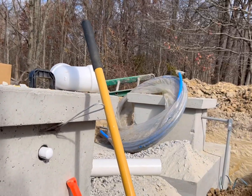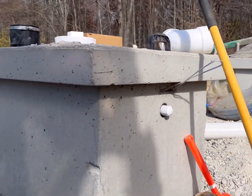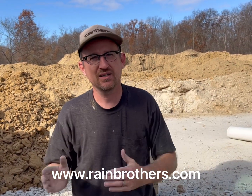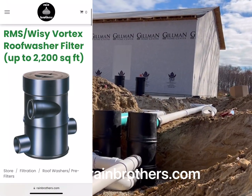On this particular setup with three concrete tanks, the farthest one down the line away from the pump is where we put the drainage inlet. The pump tank is that first tank where the electric is going in. This means we have two tanks that essentially serve as baffles before water gets into the pump tank, giving us the cleanest water going into the pump tank. That's a quick way — in addition to pre-filtering the water — to ensure a clean water supply.